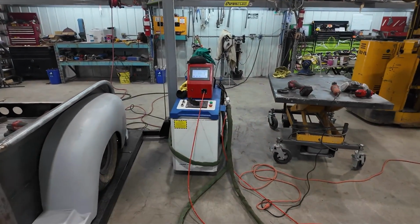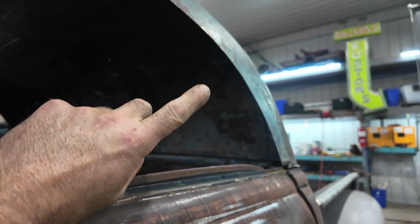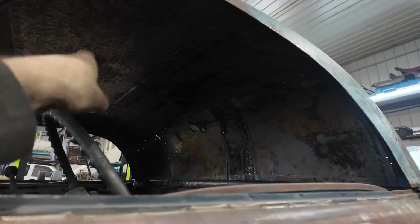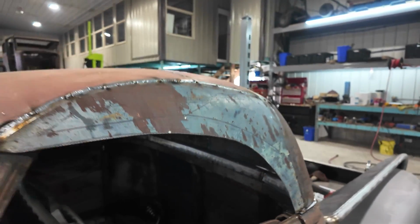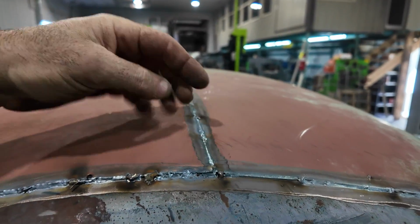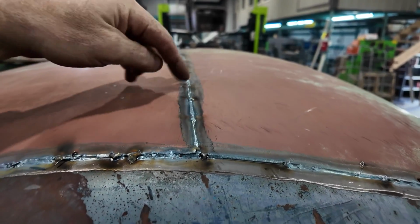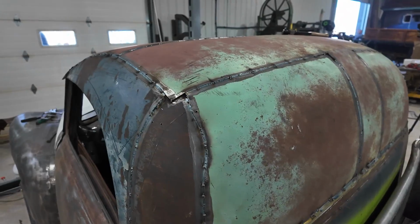I think what I'm going to do, just because this thing's still all set up, is pull the roof off and stitch even the inner side a little bit. Like, we'll kind of hit it with that thing, and that should give us some extra strength. This is probably as strong as it needs to be, but seeing how we're lapped about a half inch, if we stitch a few of those places, that'll put a little more strength into everywhere.